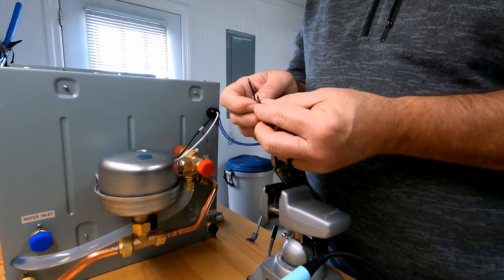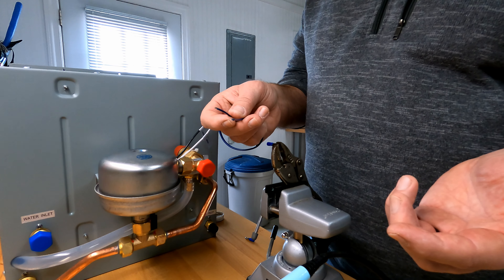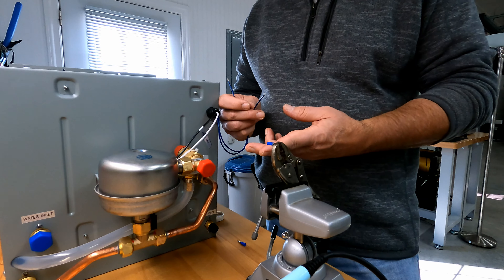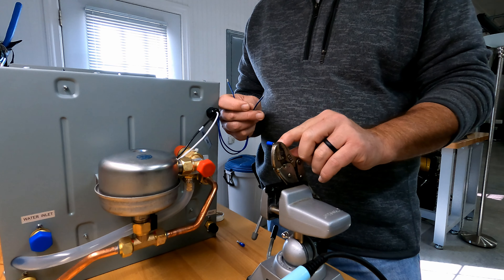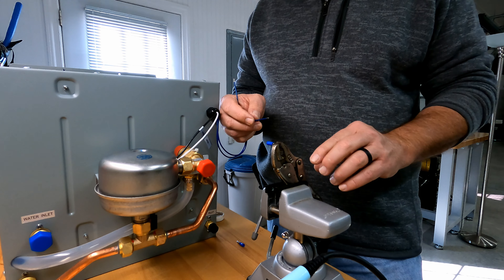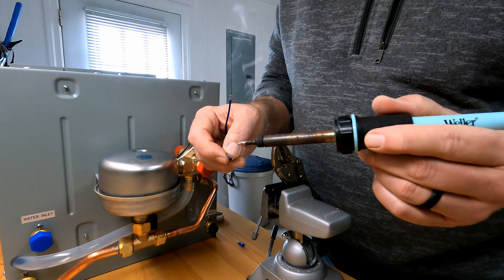Still in the shop today. I've isolated the wires coming to the original hot water heater. I've determined that the white and green wires are the power wires to engage the electric side of the hot water heater from the control panel of the trailer. The blue and orange wires are the circuit that enabled the gas side. I've already installed the butt connectors, and I've got 12 volts on that circuit. Making a little progress.